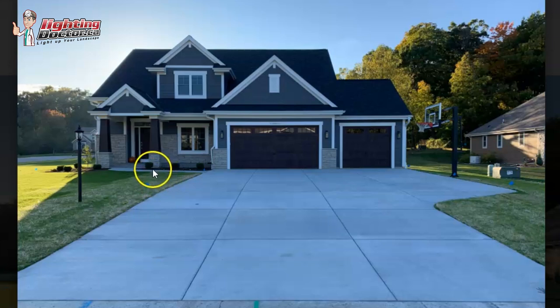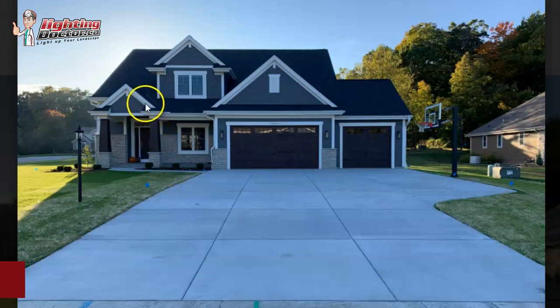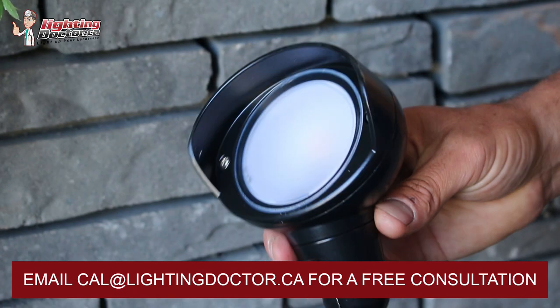I would probably try and have that at the base of the column here. It doesn't even hurt if you had it a little bit off the corner, maybe 12 inches back or so, and almost had it angling a little bit — so a little bit of that angled light is going to catch this top peak. I would do that on both sides here to really make that entryway stand out. Back here I feel like you're going to want to light — a lot of times this ends up being a bit of a dark spot, so I'd actually use a wash light as opposed to an uplight.